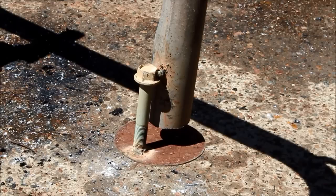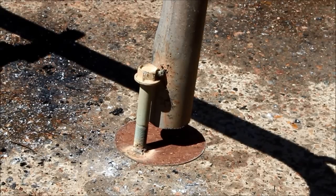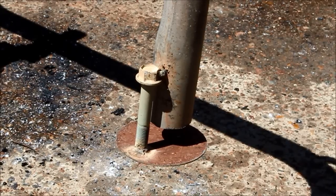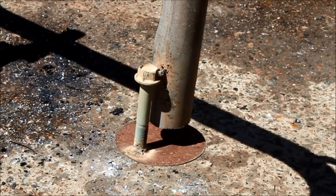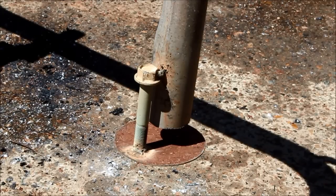The reason this will burn cleanly is because there is always an excess of air. I've done some testing with this and the amount of oil in the pot is relatively insignificant. As long as you haven't got way too much or run out, the thing seems to work pretty much just the same.